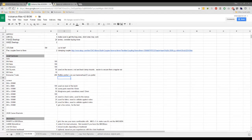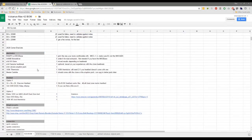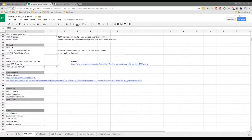Yeah, because when you've got a part with like 6 or 7 bolts to it, and then you're putting on the T-nuts to then get them all in position to actually lock it into place, and then to check that they've actually turned and you've not just tightened it to the part, is quite tricky. So that's why I prefer the roll-ins as well.